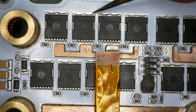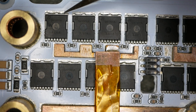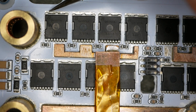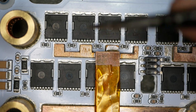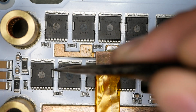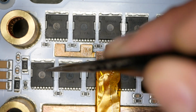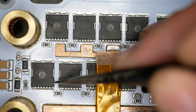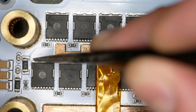And so it was placed right up here, and then they carefully shifted it down to get it to here. This one, you can see that little distinction of line right in there as well. So that one was very likely replaced and then moved down. This one here was stuck on when they first placed it on the molten solder, was quite high, because here's the line way up here, and then they moved it down, and again, you can see it's just a skosh crooked. This right here is just a little bit higher than that is right there.